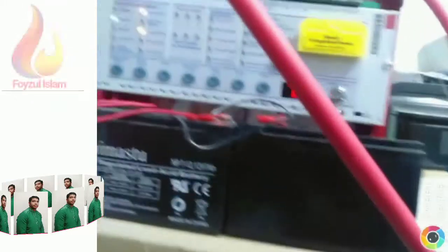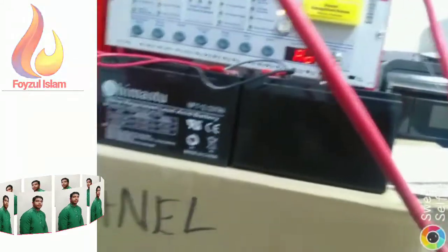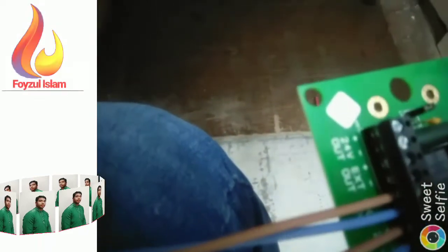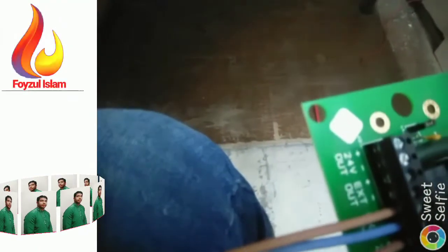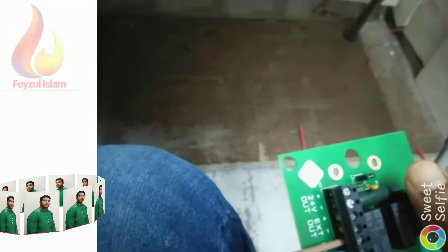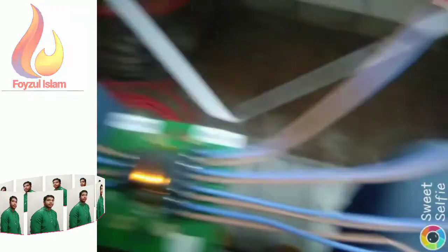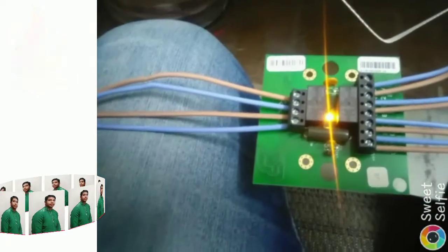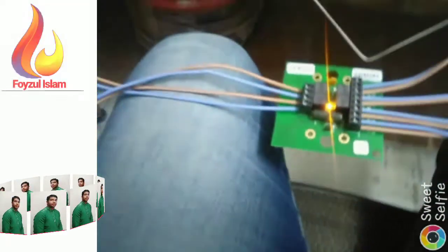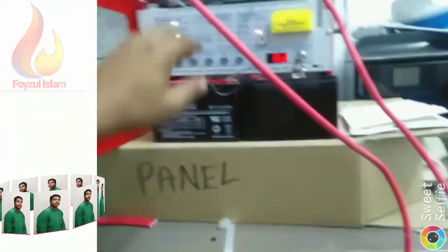No need to connect an end-of-line resistor or diode on the exit option — remove it from there. On the last sequential activator, no end-of-line is needed on exit-out either. Just leave the jumper link on the last unit on the line, and remove the jumper link from all other sequential activators — that is the complete procedure.